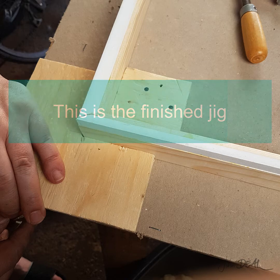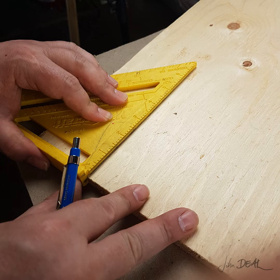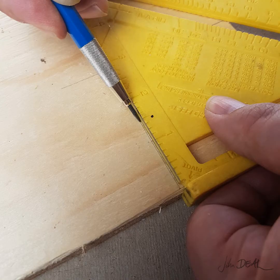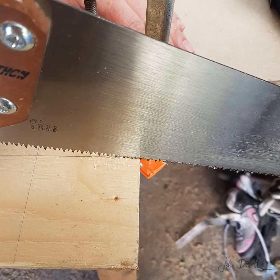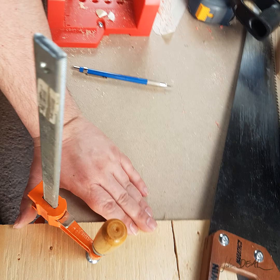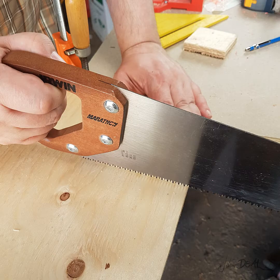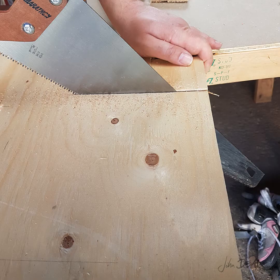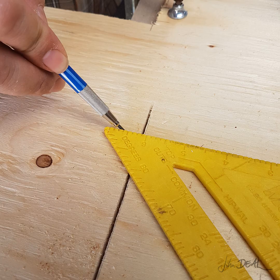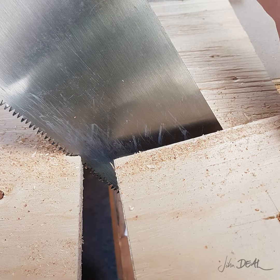If you don't have a miter vise, we'll need to make a jig to help us square up the corners. This is a simple jig — we're going to cut a 3 by 3 inch square out of the corner. This is the factory cut corner so I'm more confident that the outside edge is square. We'll measure back 3 inches from the factory edge on each side and cut this part out. After this piece is cut, I'll measure back another 3 inches from the edge and make two more cuts for our second matching piece of the jig. The trick is making your cut straight. Using a miter or table saw would probably give you better results. Even a jigsaw with a fence would yield more accurate cuts. For our purposes, I just used a handsaw and then corrected any errors by whittling it down with a sharp knife until it was good enough.